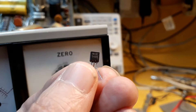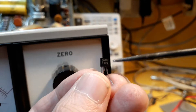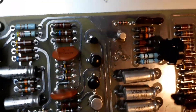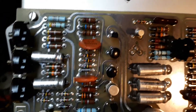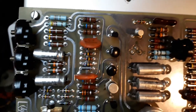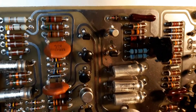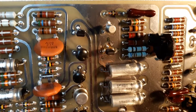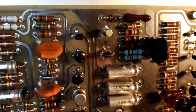So I found myself a BC548 that's got the same pin out — collector, base in the middle, emitter on the other end. What I'll do is, since I've cut off the legs of the old transistor, I'll just pull them out. I won't bother to take the whole board out — I'll just suck all the solder out of the holes and put the transistor in from the top, and that should be fine. The transistor is now in there — wasn't too hard to get the old legs out, suck the solder out, and now I just reposition everything and see if it still works.